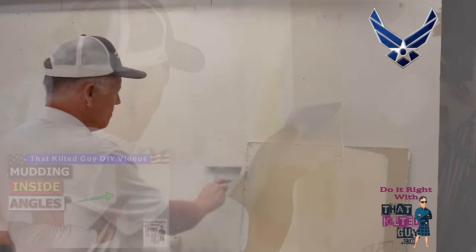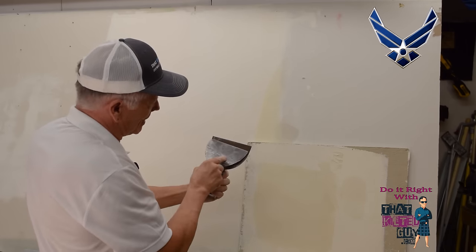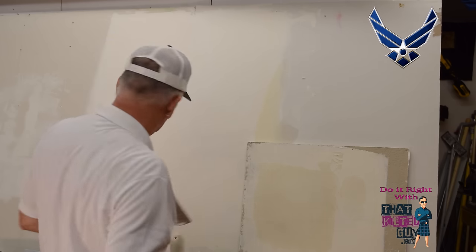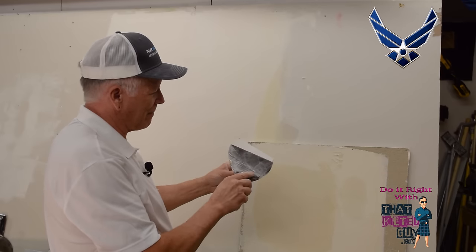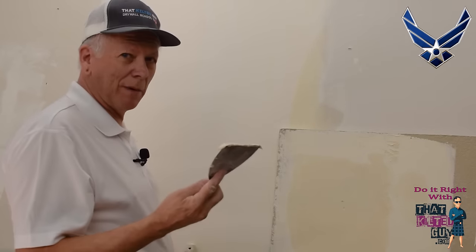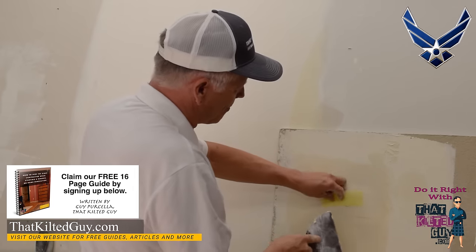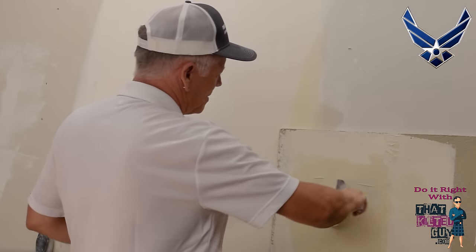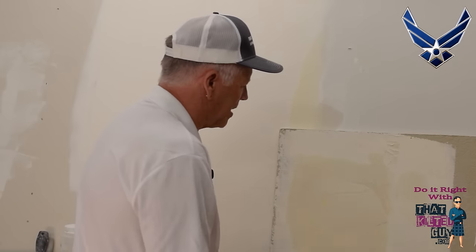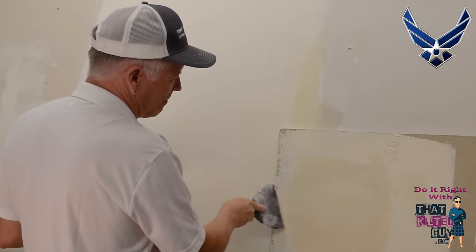That's why it's made that shape — you don't want one that curves in right away. Even this cheap knife I have still has that perfect shape. The other thing this is great for is taping. This is basically a taping knife, not a floating or finishing knife. You put some mud on, lay your tape in, and tape it. It's the right size — great for spreading mud and getting that first initial coat, about six inches wide for a recessed joint.